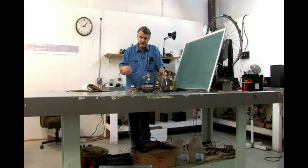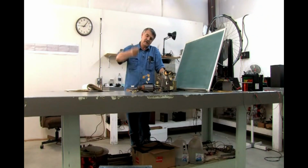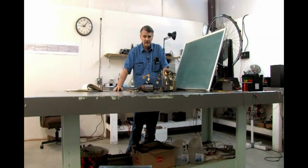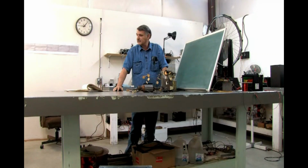And the little thing about Lockridge was that after the war, he was known as the town drunk. And anyway, a little explanation of the machine. This machine was a converted Bosch generator that had sort of like a pull cord. And you flipped a switch, and you wound the cord around it, and you gave her a pull. And she took off and went ding, ding, ding, until she got up to 5,000 RPMs, at which point in time you could draw a maximum load of 300 watts. And of course, at that time, it was light bulbs, because they were using it for lighting and a small little wire-wound 6-volt heater. But if you exceeded the 300 watts, you killed the machine.